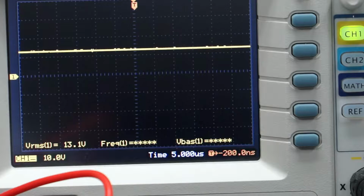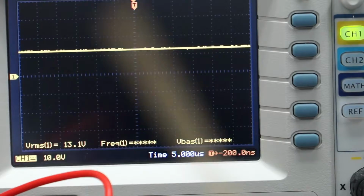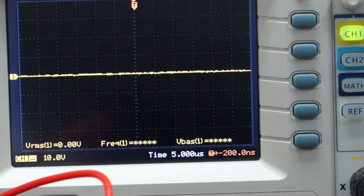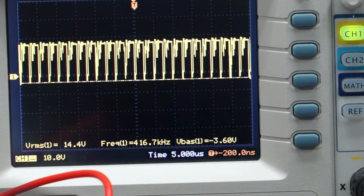So the first thing that I did is I fixed the issue in the charger circuit where the power for the charger was not able to reach the buck converter because that transistor was physically destroyed, and so were the pathways on the board. I shouldn't say the transistor was destroyed because I didn't test it, but the pathways on the board were not actually there. And what I did to fix that is I ran that wet wire. Now, even after I did that, this still was not working. It wasn't working because the one-wire circuit was not working. So if the one-wire circuit is not working, the SMC is not going to tell the U7000 on some boards that it can work.